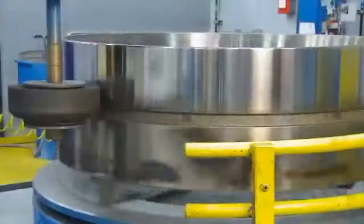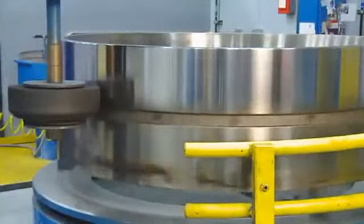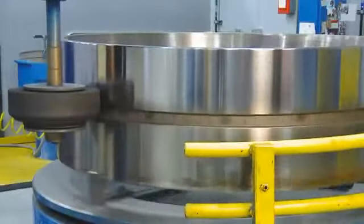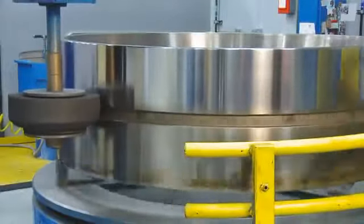After the quote is accepted, the bearing's non-raceway surfaces are polished on one of several machines. While polishing improves the appearance of a used bearing, it's also important to restoring its surface finish. A smooth surface finish is critical to bearing performance.